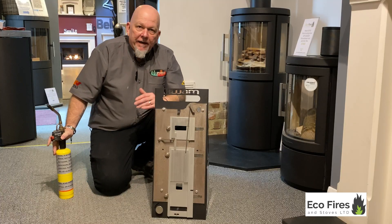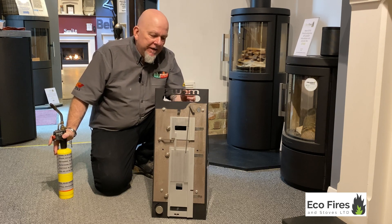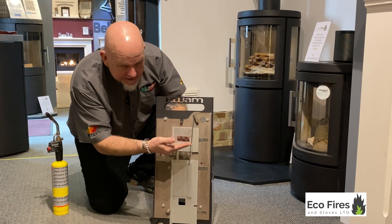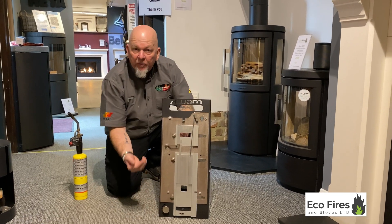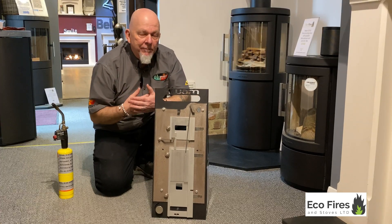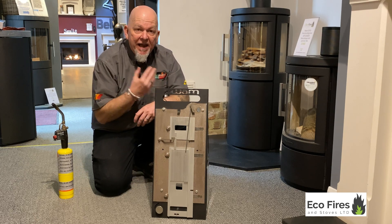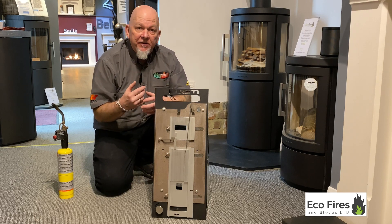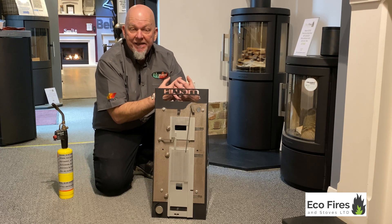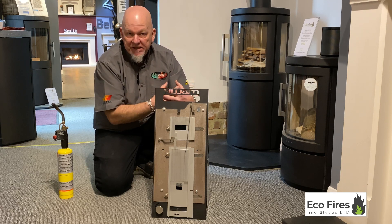The cooling down process takes a lot longer, so you wouldn't want to sit watching a video of that happening. When it cools down and realizes it's not getting enough air, the bottom air control will open up again, introducing more air. So if you put in more fuel it's going to get that lit very quickly, or if it's the end of the burn it's going to open up the control and burn off all that ash and embers, and you'll come down to a nice powdery ash and a clean fuel bed.